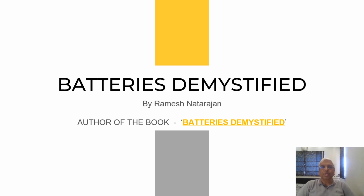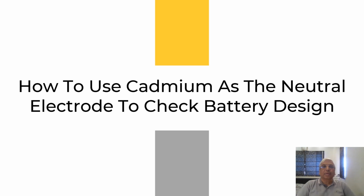Today I shall be talking on the topic of how to use cadmium as a neutral electrode. I have made this video in response to requests from listeners of my podcast in which I had talked about how to use cadmium as the neutral electrode to check battery design. The cadmium electrode is used by battery designers to check battery performance mainly during the discharge of the battery or the cell. It is also used in production at the time of plate formation and battery charging.